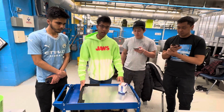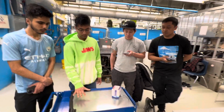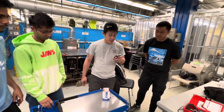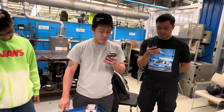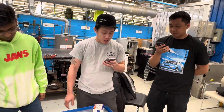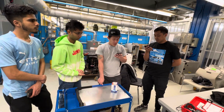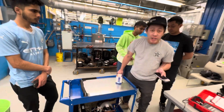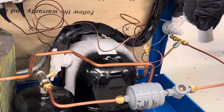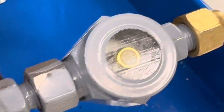We had some frosting on our pipes and used insulation to cover them. For the final test, we charged the system with refrigerant and managed to get the superheat reading from the evaporator. We confirmed there was still no leaking in the pipes. We also adjusted the TX valve to make sure it doesn't overheat the compressor, and monitored the superheat coming into the system.